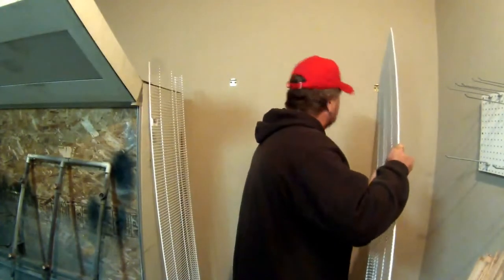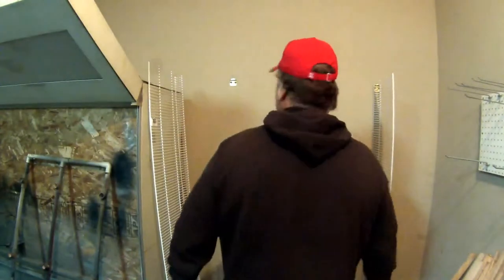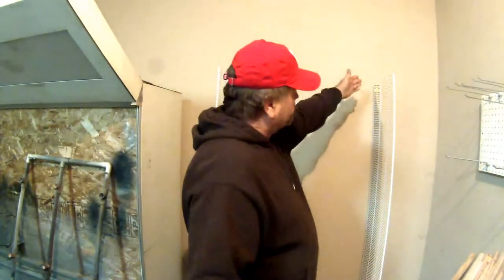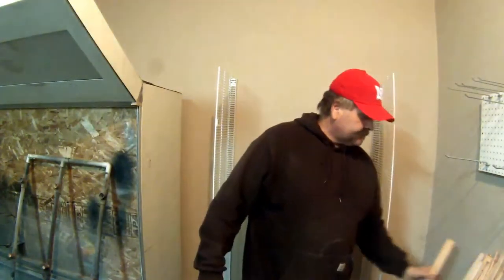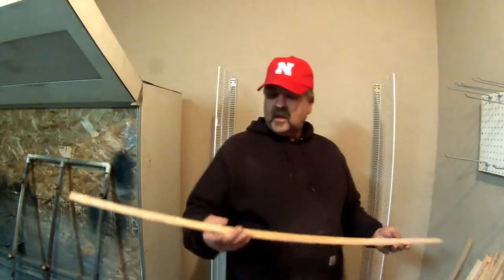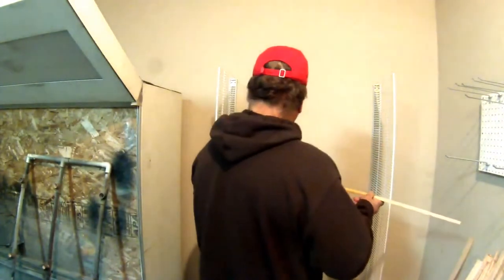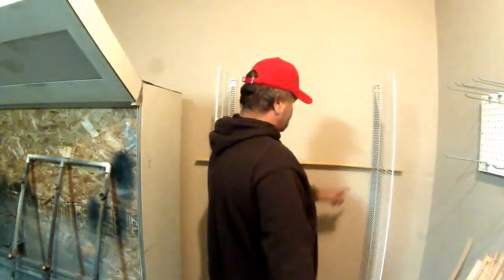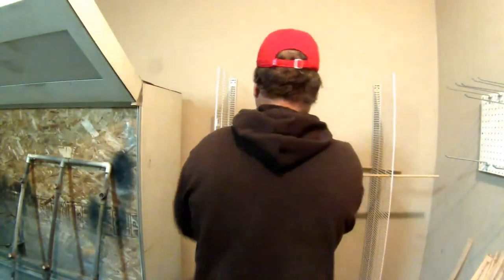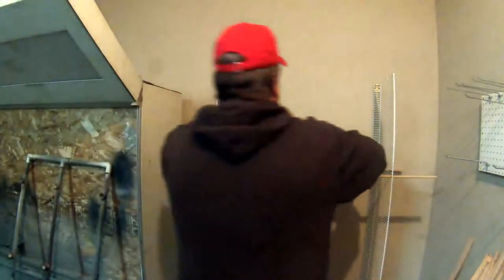Let me just check this. Yeah, that's it right there — that one's in place, and that one's in place. You just set them on the floor and screw the screws in, and that lines them up perfectly. Now, a bundle of lath — six, seven bucks, maybe ten. It's just cheap quarter-inch fur. I've got marks on these so I know what's level across. I can see this line here and this line here should be about the same. So there we go — two little sticks. Start at the bottom, work your way up, and you've got yourself a shelf.